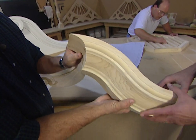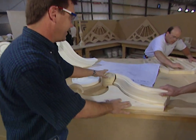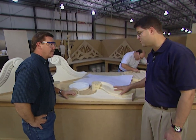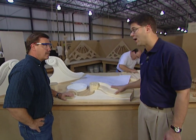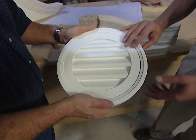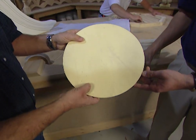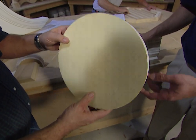How long does it take to make one of these? A pattern like this could take up to two weeks of somebody's time to actually make. Well, that could cost a couple thousand dollars. It can be very expensive, and that's one of the things that's so great about polyurethane — we can replicate the detail and intricacy of a wooden piece like this, economically. This is the finished product in a smaller version. It's a very durable product, dense, a rigid polyurethane, impervious to moisture. It doesn't rot, insects don't like it, and it has a lot of advantages that wood doesn't have.